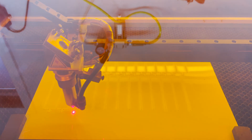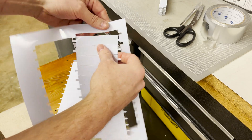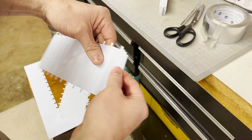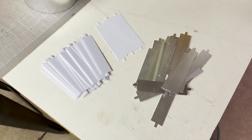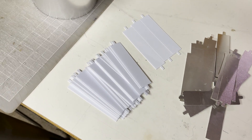I couldn't find any accordion bellows to buy that would ride in the groove of the 2020 extrusion, so I take a stab at making my own. I start by cutting out some pieces out of plastic on my CO2 laser, cutting just barely through the plastic so I could easily pop them out rather than chasing individual pieces all over my laser. Here are the finished pieces.